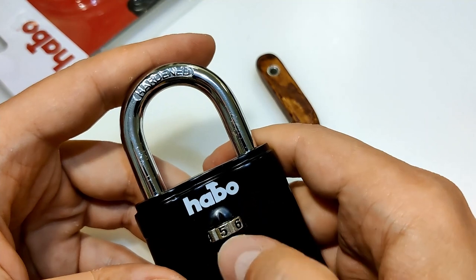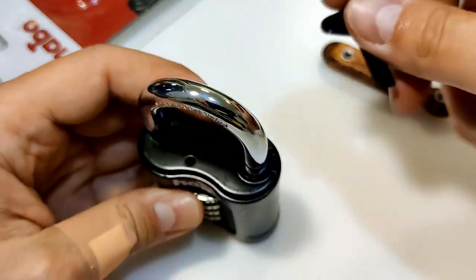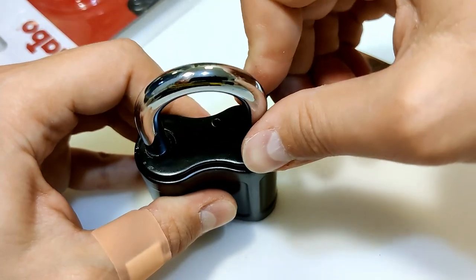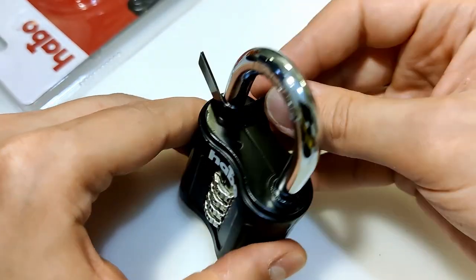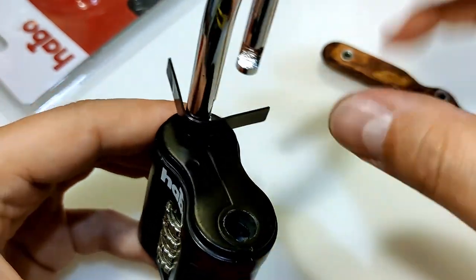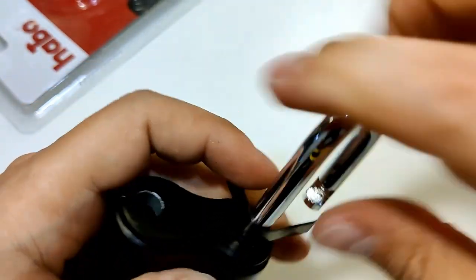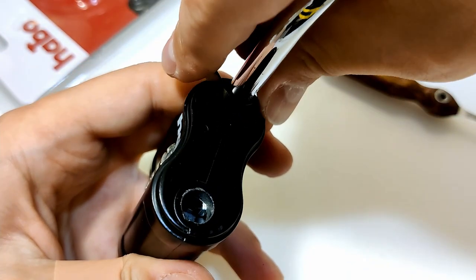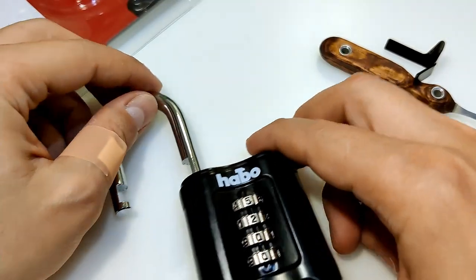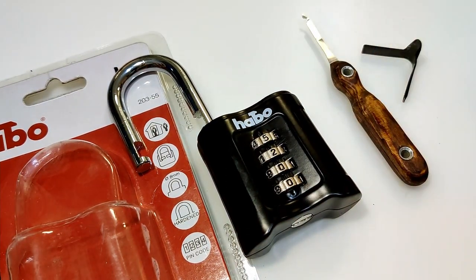So if I lock it, I'll show you the proper way to open it. You go with the shim not on the right side but on the left side — even though there are two locking bars, you need to move the left one, which moves the right one. Just insert the shim like this, turn clockwise to about this position, and move the shackle. There it is — you can see the right one has moved. If I remove the shim you'll see the right one pop up. Inserting the shim again from this side and moving here — you can see how this side moves that locking bar. So it's not really two separate locking bars; it's like two bars controlled by one mechanism.